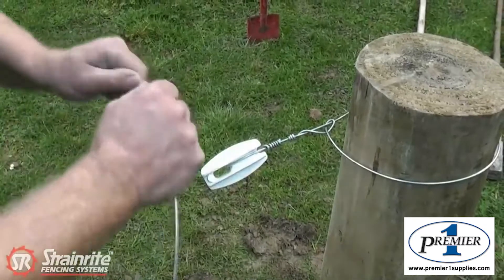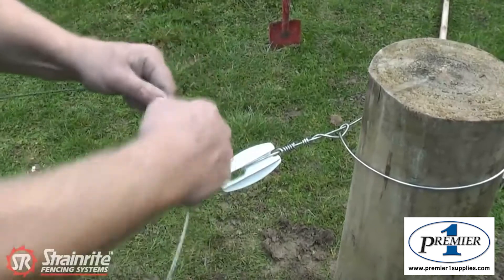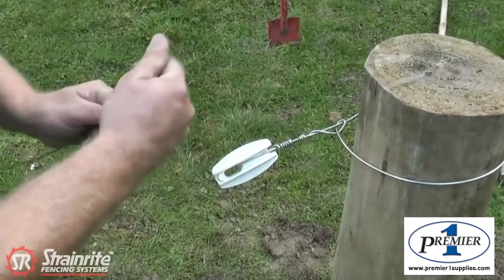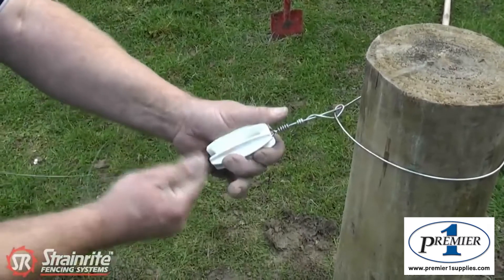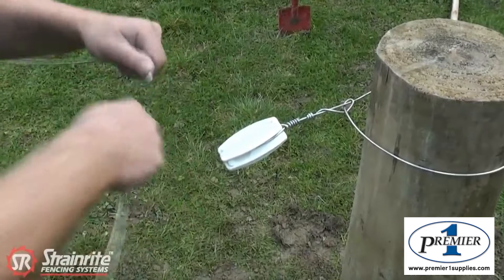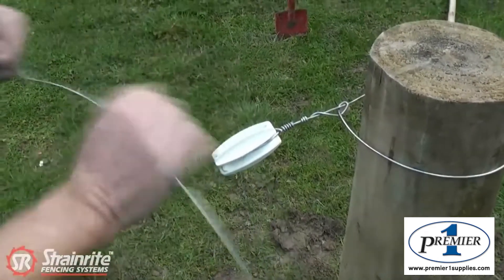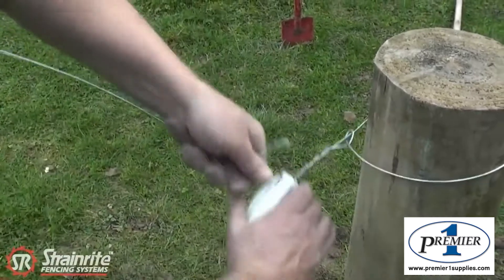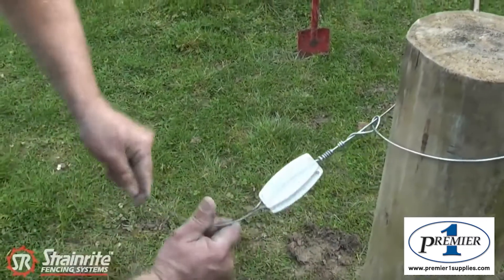Putting the second wire on, we do what you call a Mexican hat. Give yourself plenty of wire to work with, bend the wire round, and then measure from about the middle of the hole to the front of the insulator. Put it on that measure and bend it in front, bend on the corresponding side, thread it through — and now it's going to cross in the front and it's going to pull off the centre of the insulator.